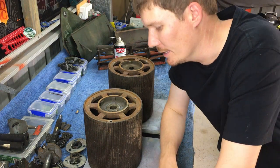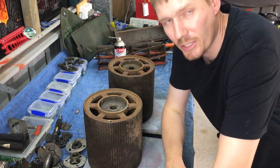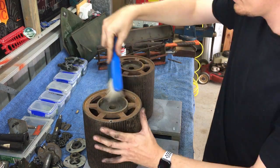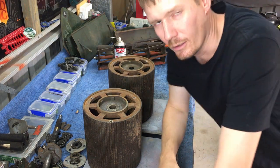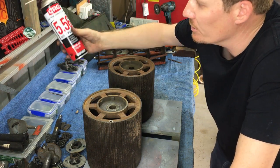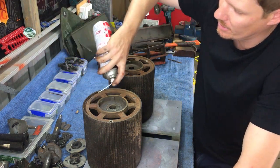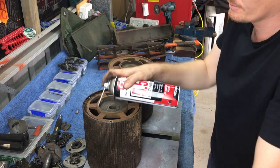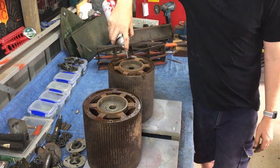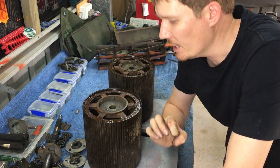Okay, that won't make sense right now, but you'll see soon why I did that. So now we've done that, make sure we clean all that up as best as we can, so get as much dirt off that as possible. Okay, so once I've done that, I'll get my WD-40, or I'm using CRC 556, same thing, it's just a multi-purpose lubricant. And I'll spray that right around the edge. So definitely don't go light on that, use a lot of it.